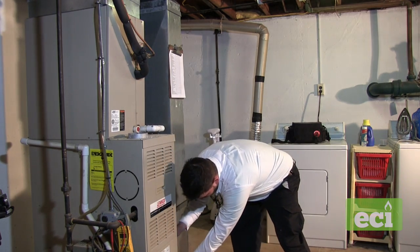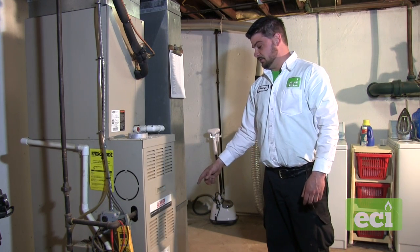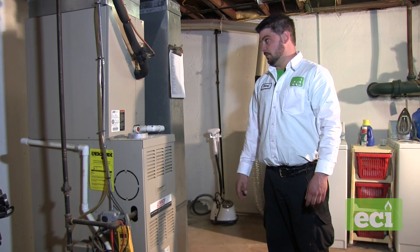This cap goes over top of the air filter. You also want to inspect the ductwork where it attaches to the unit to make sure it's caulked. Otherwise, you can replace the air filter but it'll still suck in dirt from those cracks.